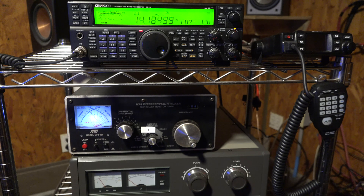Back to the CW dead key — power output on the display is at 100%, whatever that's supposed to be. I'm not sure if they mean percentage or actual watts, but I believe they mean actual watts. On the radio's scale it appears to be 100 watts, but the external meter on my antenna tuner shows 78 to 80 watts. The only reason I started noticing this is because I just bought a Kenwood TL-922A linear amplifier.